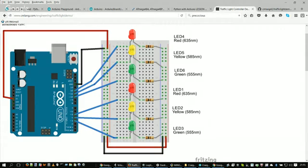You just push the wires down inside that little hole, and as long as the diameter isn't too big to poke the hole out or cause any problems, it just goes down inside the hole and makes a connection to any other pin that's in that row on that side of the gutter.